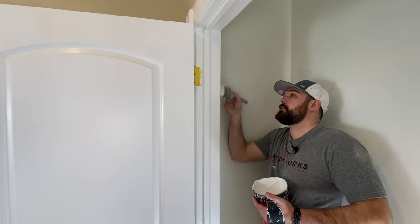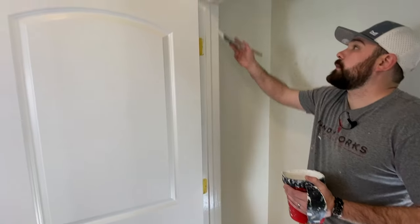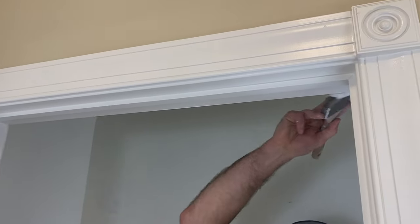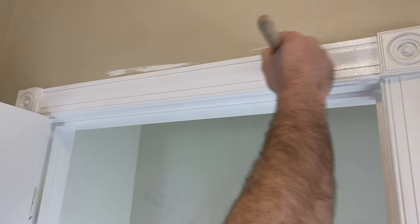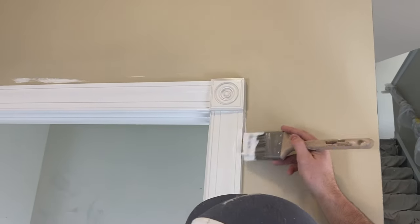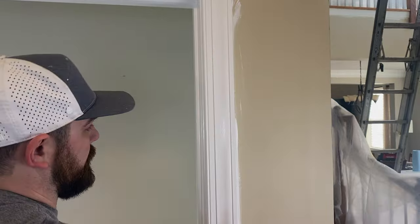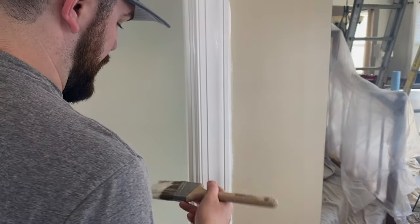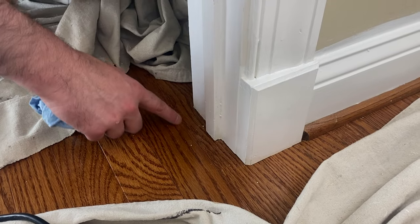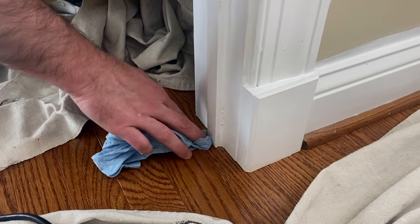On the inside you also want this to look like one long brush stroke. Because we're going to paint the inside of this closet, I can run the trim paint onto the walls in here as well — not a big deal. I'll go ahead and do the top piece then work my way back outside. With the grain on the top piece, it should look like one long stroke that way. I like to run the outside edge that touches the wall first, then fill in — because doing it after can affect that line and I want it very smooth. Just police for any little drips when you're done; if you haven't taped out, you might have some flecks from the brush — super easy to wipe those off with a paper towel while still wet.